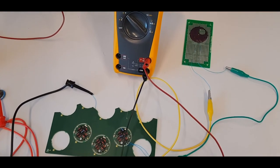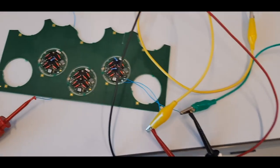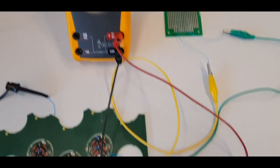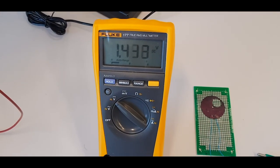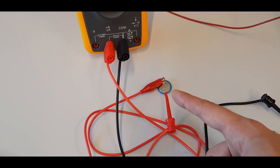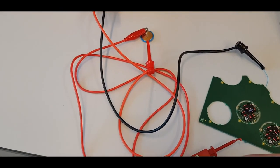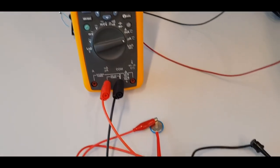So as you see here, I connected the solar cell directly to the DC in, and there is this multimeter here, which is reading the voltage of the solar cell, and it's also connected to these two pins here, which go directly to DC in. And the voltage here is around 1.4 volts. And on the other side, I put the battery here, and from one side it is directly connected to the battery, and from the other side it went to the current meter. And also then again it went to the battery.